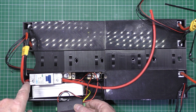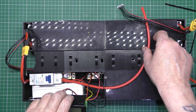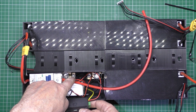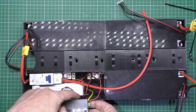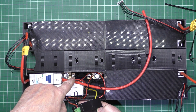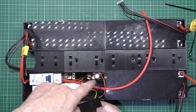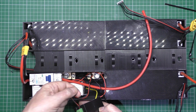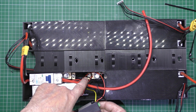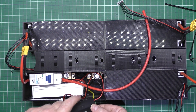The positive goes through the breaker and then it comes straight out to this one here, which I don't want anywhere near that one. On the shunt, the current sense, there's two wires which goes into those two wires here. So there is actually a positive and a negative side - the negative side goes to the negative of the battery. The positive side, because the current's flowing this way, goes into the positive terminal. The regulator's actually plugged - one end's plugged into there, and the other end is just earthed on the shunt. So what I'm going to do now is switch it on.